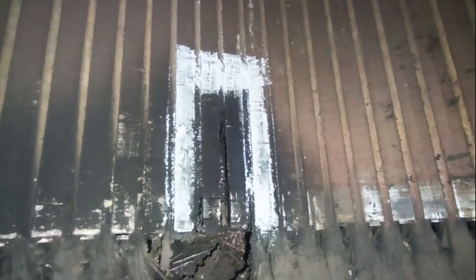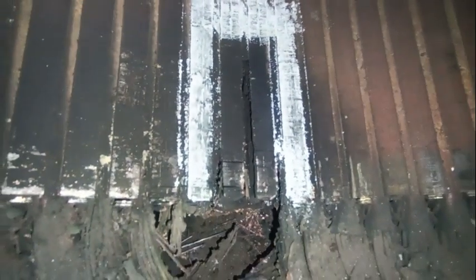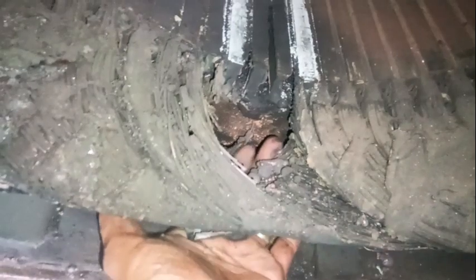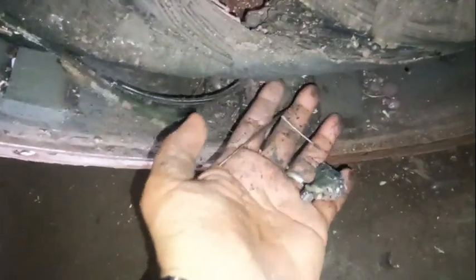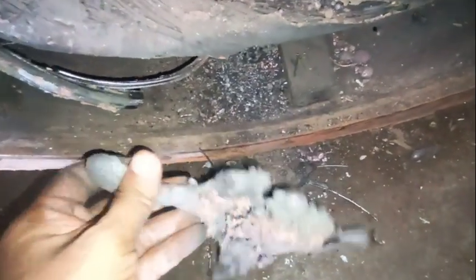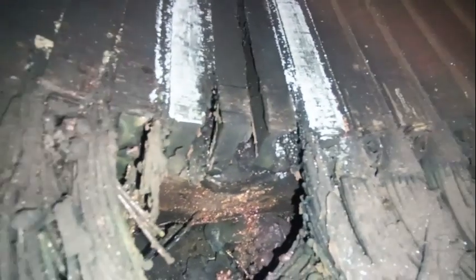The reason for failure is mostly due to aging or mishandling at the time of rewinding. This mica coating gets damaged, and this damage leads to hotspots. Hotspots and how to detect them are discussed in my previous videos — I will keep a link on the i-button. So eventually, hotspots damage the full core. When the mica coating from the sheets is damaged, hotspots are generated, which give rise to excessive temperature, and this temperature ultimately melts down the mica sheets, defecting our stator core.